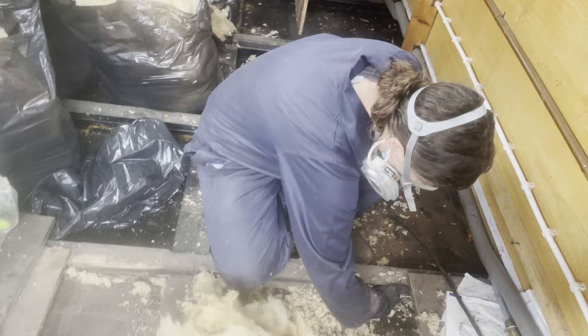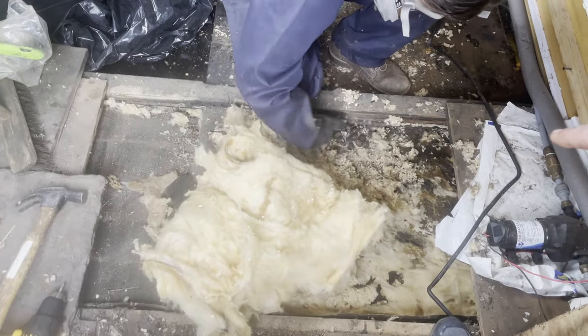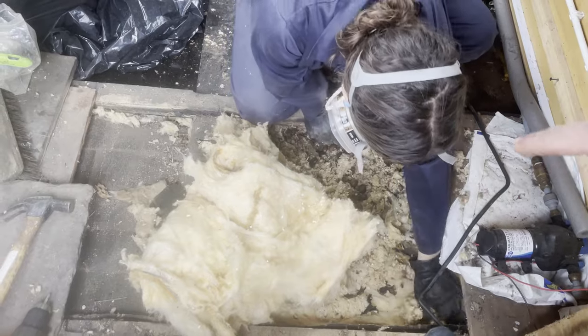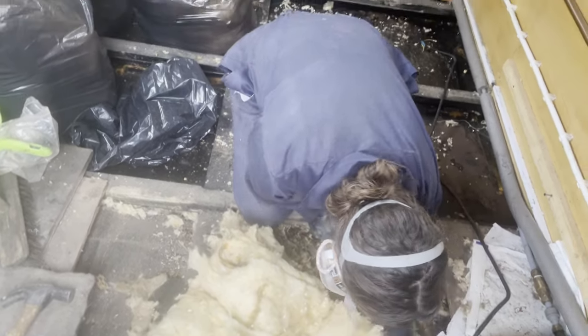This insulation is bad for this job underneath the boat. It might be alright for the walls, especially at the top of the gunwales. But this is bad because if it stays and gets soaked, it won't drain, it won't dry, and then it rusts the bottom of the boat. But it looks like there's been mice that have squirreled away a load of nuts - and there was a whole pile of lentils as well, which was rather impressive.